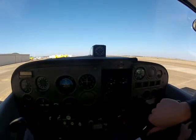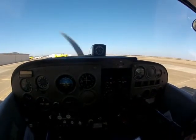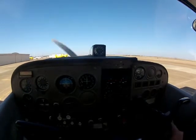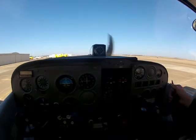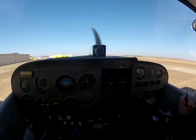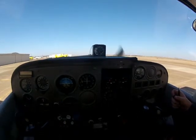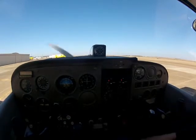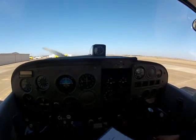So I'm going to go all the way back with it, turn the other way. The other ailerons are deflected the correct way — the right one's up, the left one's down. That's good. Then I'm going to go back and look at the tail. My elevator is deflected up, then deflected down. Rudder pedals right and left. So all my flight controls are free and correct — nothing's hanging up anywhere, and they're all operating correctly.